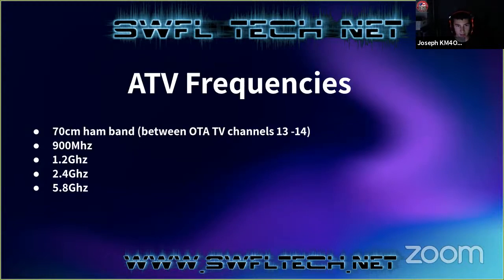There's not as many frequencies you can use with amateur television compared to broadcast TV, mostly because it uses a lot of bandwidth. We can't use it on HF because it would use up about 6 megahertz for one stream of video. So you'd be using up multiple bands on HF with a 6 megahertz carrier.